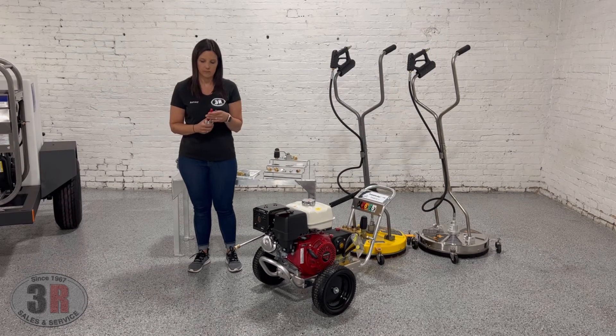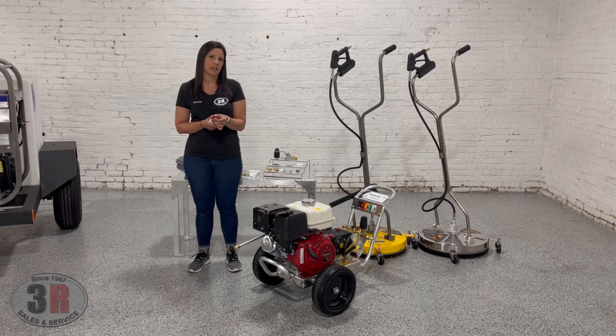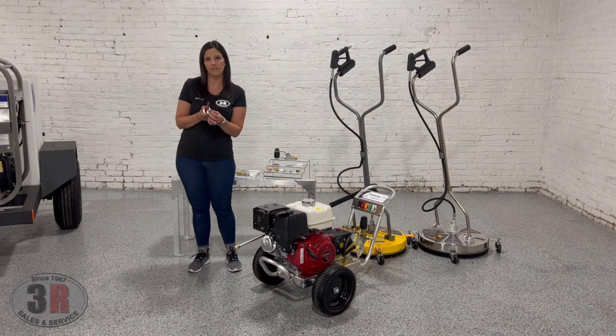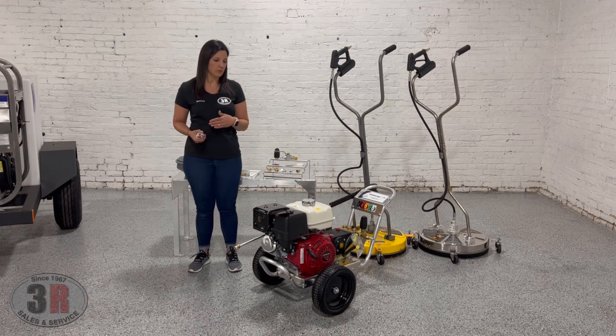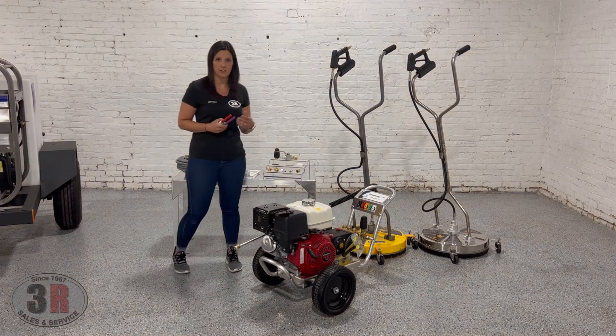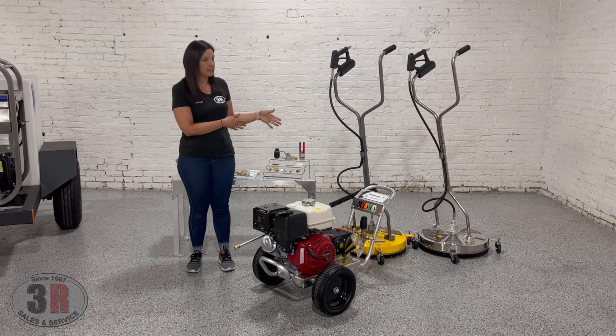This other component is our illuminator assembly. What the illuminator does is it has two long-range nozzles and two close-range nozzles — a zero degree soap nozzle and a zero degree rinse. The soap nozzle applies your soap at low pressure, and the rinse nozzle provides about 1,000 to 1,500 PSI for rinsing at long range. Same for the fan nozzles — there's a fan soap and a fan rinse. It's nice because you won't have to go back to your machine to throttle it down; you just use these nozzles and it drops your pressure for easier rinsing, especially for vinyl applications.